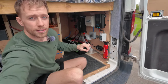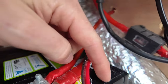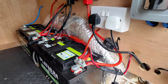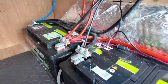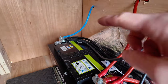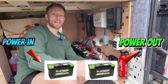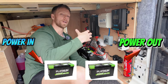It's important with these batteries to make sure they're vented — they come with a little vent hole here and you need to vent them to the outside. I've done both of them to prevent any gases from coming in. The batteries are connected together with 35mm cable, positive to positive centrally on both, and negative to negative. I've earthed that with 25mm cable to a really good grounding point behind here. To get an even draw off all batteries, everything that charges goes into one battery and everything that draws comes out of the other.